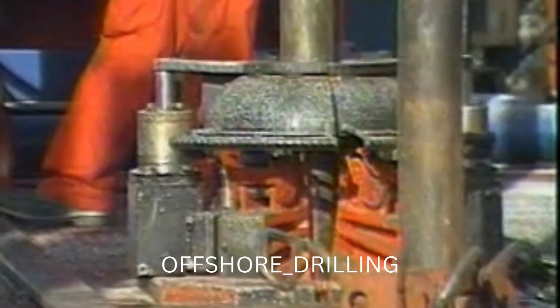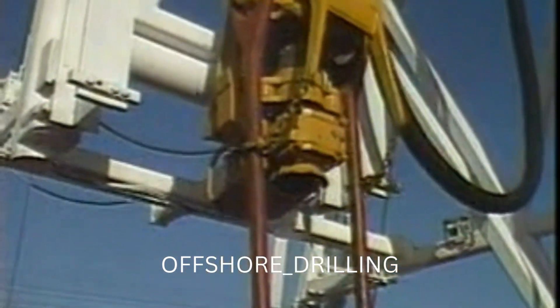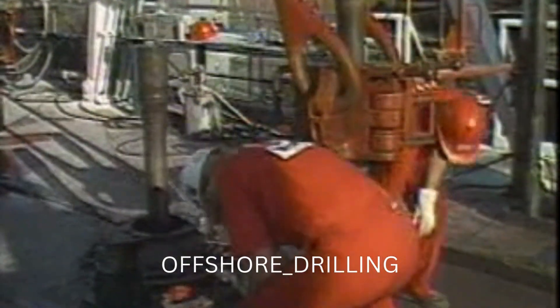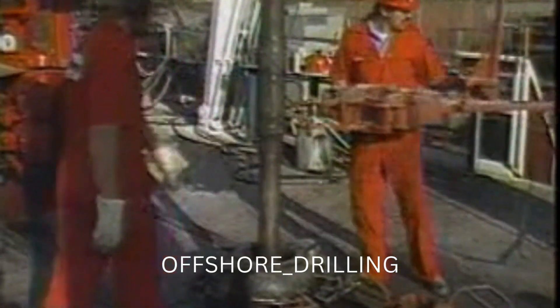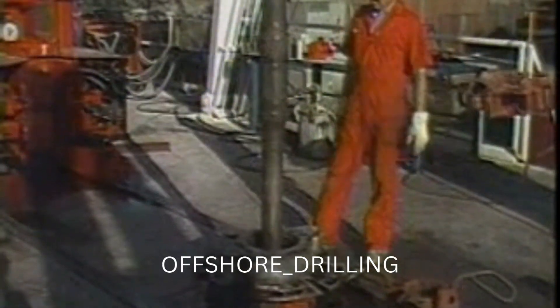Singles may be made up from the mouse hole just as easily. When the stand is drilled down, the slip set and the connection broken, the driller actuates the link tilt feature to extend the elevators to the mouse hole, where they're easily latched and the new joint is hoisted and stabbed into the string. The single is made up in the same way as the stand and the system is drilling ahead in about a minute and a half from the time the slips were set.